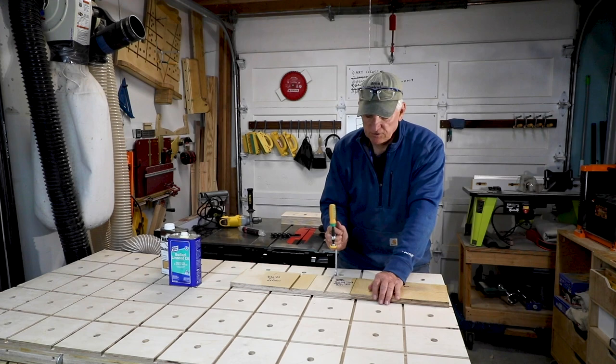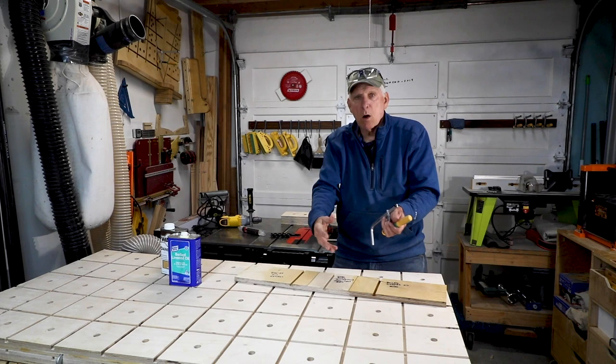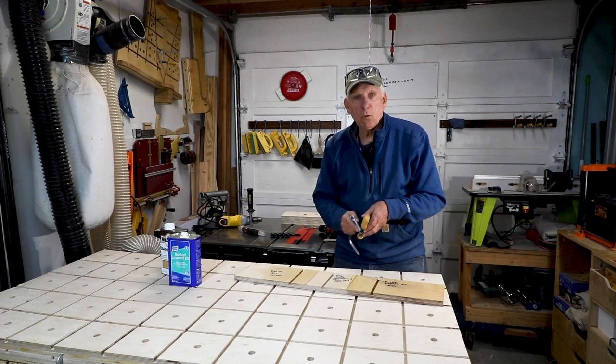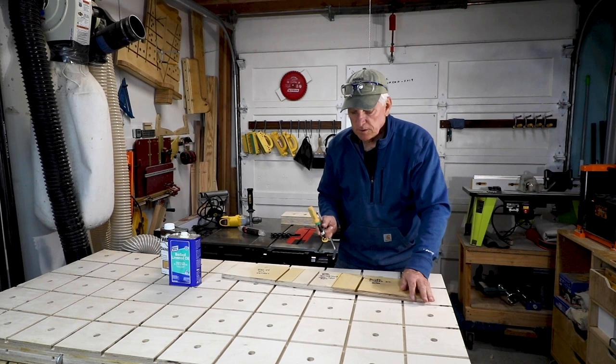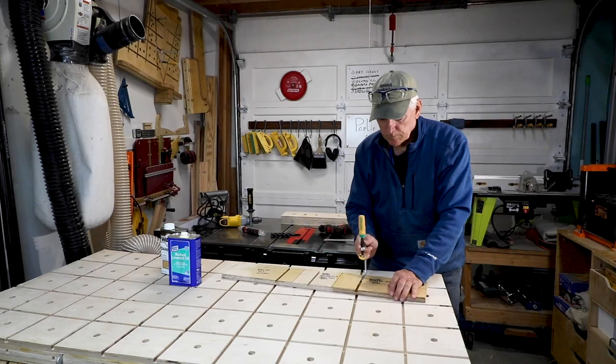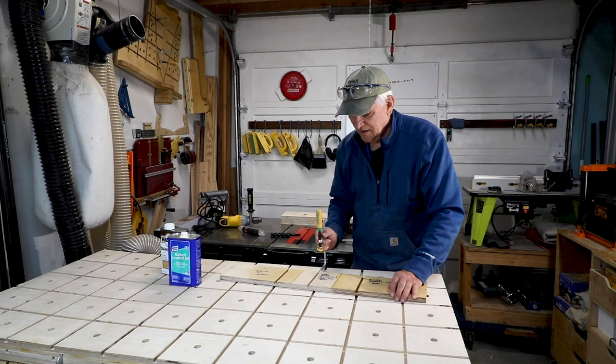And I think maybe the water base swells up the wall of the matched fit groove. And so you could probably sand it down enough and use a little small chisel and get it working better, but that's a lot of work. Let's see if using a different finish is just an easier way. So here's the 50-50 boiled linseed oil. Put that in there, and again.